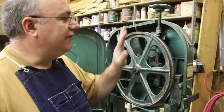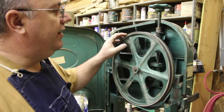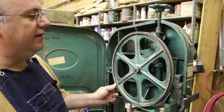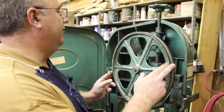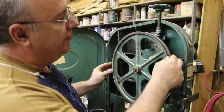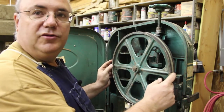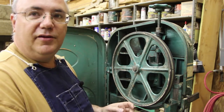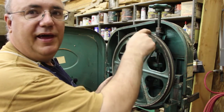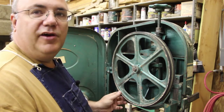The first challenge is we have to get the old tires off, and I'm going to start on this upper wheel. This tire is actually in much better shape than the bottom one — in fact, I could probably get by without even replacing it. But I got to looking at this tire and it's got some issues that I don't like. I don't know who put this on or when it was put on, but it's not a solid rubber ring. This is actually two pieces of rubber. There's a joint right here and there's a joint about opposite of it, where it was two pieces that were put on here and glued in place. On bandsaw tires, it should be like a big rubber band, a solid piece that has no joints in it, because every time that blade goes over that little track right there, you're going to get a little bump in the blade. So we're going to remove this one as well as the bottom one and replace both of these tires.